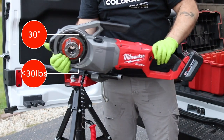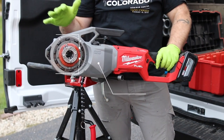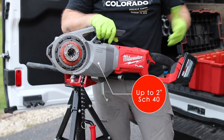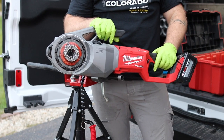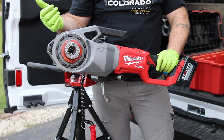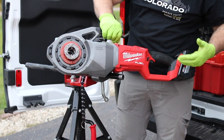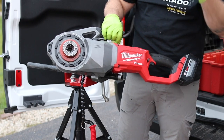You can handle this overhead — it's not overly heavy. It's about the same as other portable threaders out there. This will thread up to two inch, and they're telling me on an 18-volt battery it'll do about 20 to 25 thread cuts on two-inch schedule 40. With the correct dies you could also do conduit. I'm not sure about stainless — maybe smaller diameter in stainless. Either way, I wanted to show the tool in action, point out some key features, and thread up some pipe.